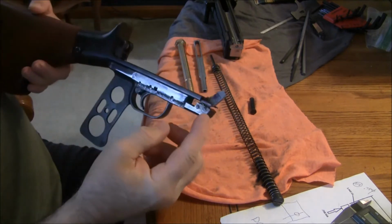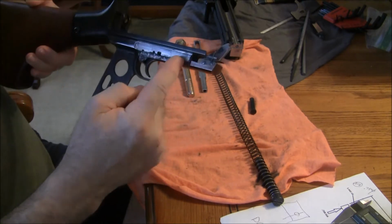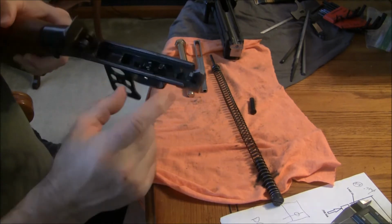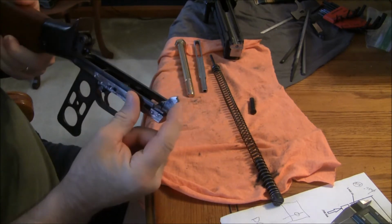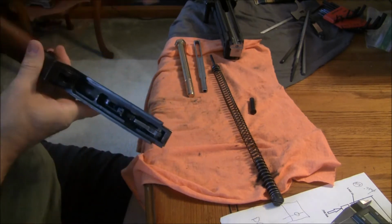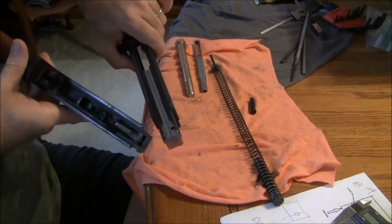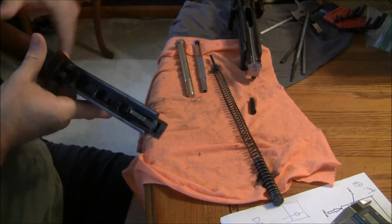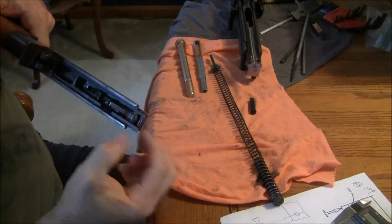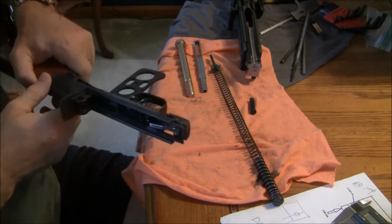But my trigger, the Savage, was a steel trigger group, that way I could weld it directly. The mods to the trigger were minimal. The hammer was cut down and the sear corrected to clear the slide. The slide is machined with a groove in it to clear the hammer and the sear. I turned two steel bushings and put one on each side of the hammer to keep it centered. And that's about it for that.